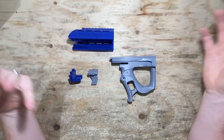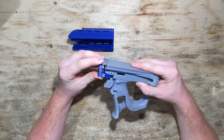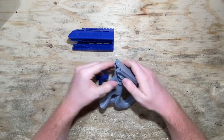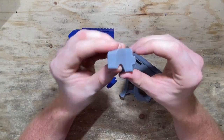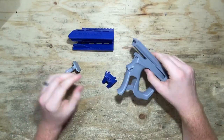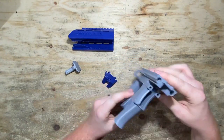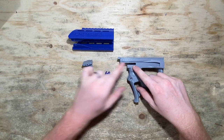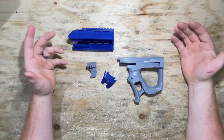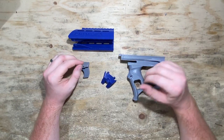Let's assemble the trigger grip handle. The trigger is going to fit into this groove, and this trigger piece is going to slip over everything here, with the trigger moving back and forth in this groove. However, right now mine is super stiff and it's just not going to move — we can't have that. I can rub my finger along these surfaces and feel that it's kind of bumpy — there's some leftover scuff from the print. Also back here, we've got those little dots from the printer. So I'm going to take a file and file out the inside grooves of this notch as well as the surfaces top and bottom to help promote that sliding action. I'll file a little, test it, see how smooth it is, then file a little more. My goal is for it to glide pretty smoothly with almost no resistance.